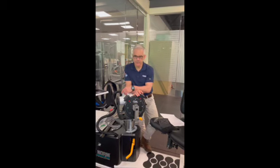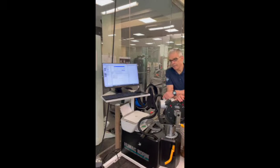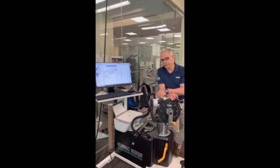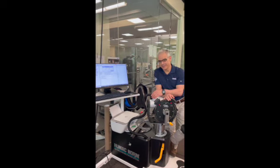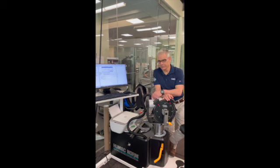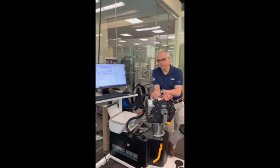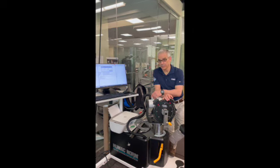How often do people calibrate? The manual says once a month. That said, this machine almost never drifts — it's just a simple strain gauge on a shaft in a controlled environment. The older hydraulic machines would leak a little, so you wouldn't know unless you checked, but these are pretty spot on.